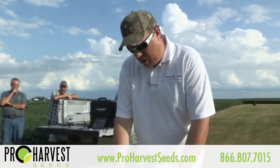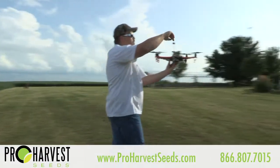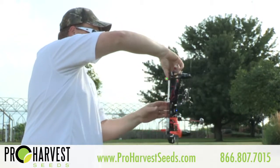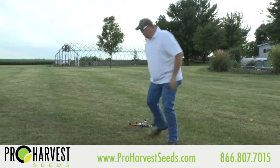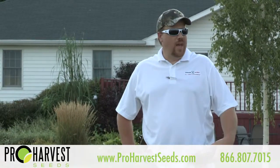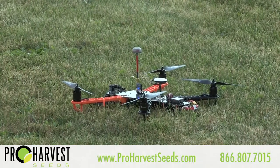So the first thing generally you have to do is calibrate these. Generally you don't want to do it standing by a truck. Metal tends to be bad for compasses. There's different color flashes. What it's doing right now is looking for the GPS, a satellite lock. When the red light goes completely away, it's got all the satellites in view. So now we're ready to go.